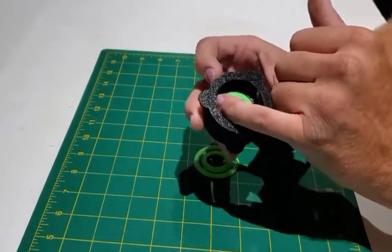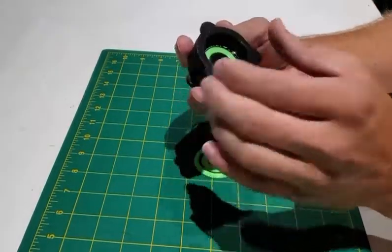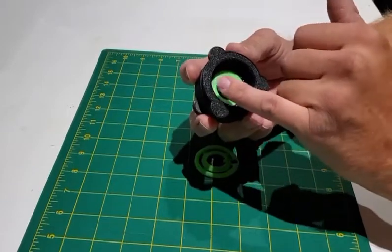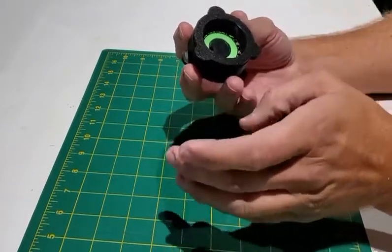And the last thing you want to make sure of before you do anything is that if you look inside, on the outside edge, you should see the metal of the bezel all the way around. Now, if you're overlapping the ceramic of the insert, there's a good chance it'll break. So that's where you want to make sure everything is centered and everything is straight.